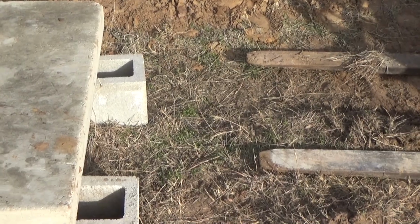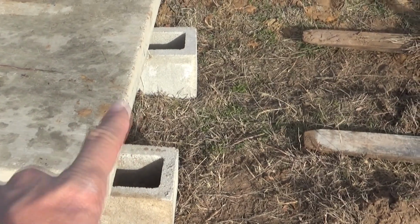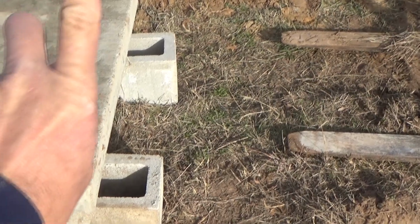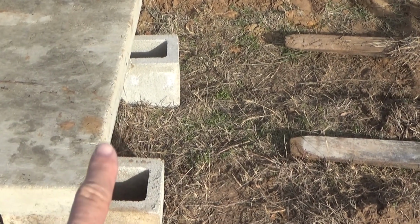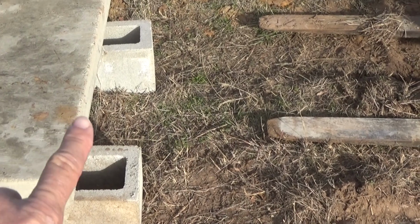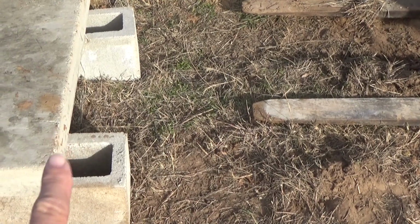If the fulcrum was actually on the ground, which is going to be that lower edge right along here, as it comes over, it would try to wipe those dowel rods off. And I was like, how am I going to get past that? So I put it on blocks like this, so the fulcrum is actually elevated. So as it rolls over, this top edge becomes the fulcrum as it goes over, and it should keep those dowels from striking anything, hopefully. We'll see.